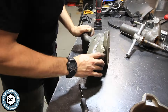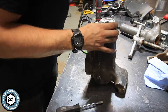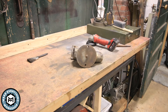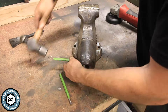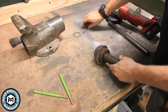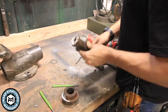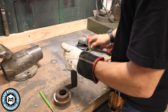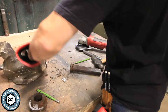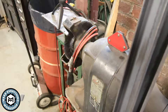With that part off, I decided to try and get the bell cap off the back. This cap retains the lead nut that holds the lead screw for the dynamic jaw. Now this thing had been welded together — there were some shoddy-looking pins in there, a bunch of goo. So I basically had to work it off, get those pins out, and figure out a way to get these two parts separated. Then there was a bunch of spray-painted grossness in there that I had to scrape off, which actually led me to see that the back section of this vise was in really good shape. What I thought was bad weld turned out to just be grease that had been spray painted.